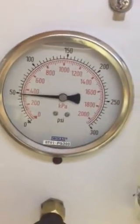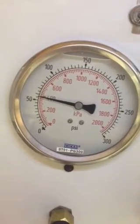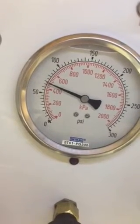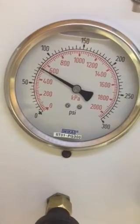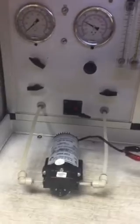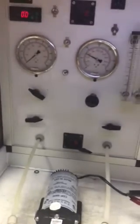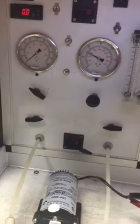You see that the noise has gone down compared to what it was before, until you start operating here about 60, 65. Now you have bypass engagement. So the point is that this type of noise that you're hearing right now is bypass engagement, which can be resolved by increasing the bypass setting of the pump.